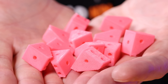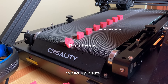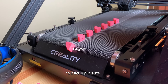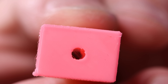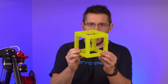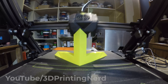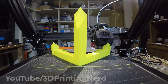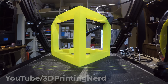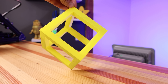I also ran some pieces for a rep box, one right after the other. This is MatterHackers build series Pink PLA. This is sort of what a production scenario could look like, and no doubt what many small batch manufacturers would use this for. This cube is a single perimeter print in PLA, and watching it print is nothing short of hypnotic. Because of orientation, there isn't any bridging happening — it's all 45-degree overhangs that the machine can handle.